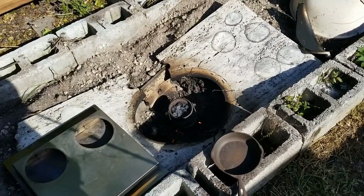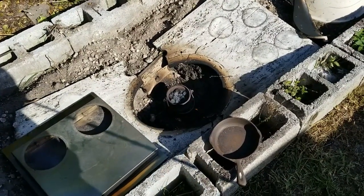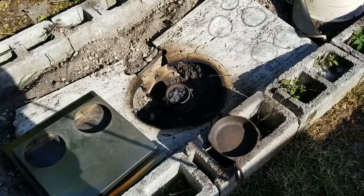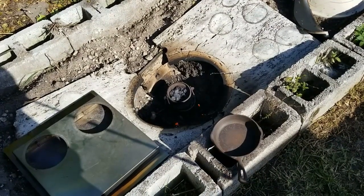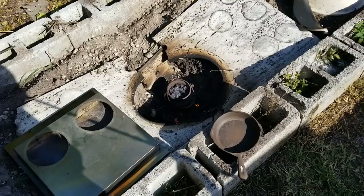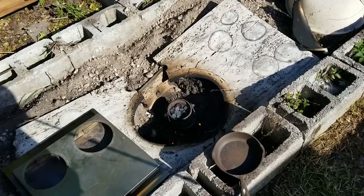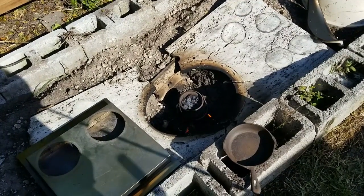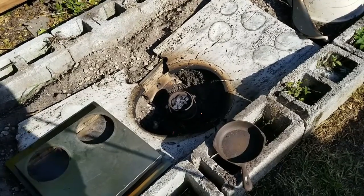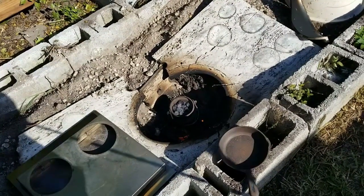And at this point, we can't really pull our grating out to add more fuel, so we're gonna call it. The copper looks like it compacted a little bit, so we're gonna dig it out and see what happened at the bottom of that crucible. But I don't think we're gonna see much. We had to get to like 2,000 degrees Fahrenheit, and we didn't make our mark. And we'll try again. We'll come up with a better design using the junk that we have.